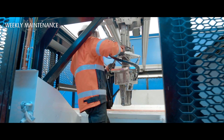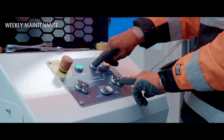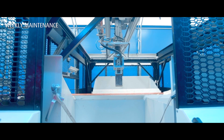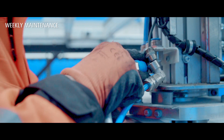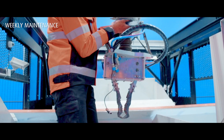Calibrate the gripper opening and check gantry calibration. If the gripper needs maintenance, replace it with a spare gripper. When replacing the gripper, move the robot to service position. Unplug the electrical connector from the gripper. Remove the three attachment bolts from the robot flange and detach the gripper.